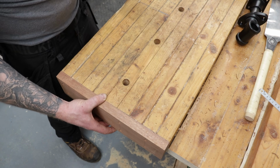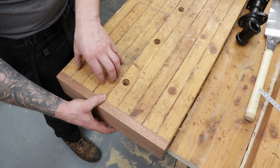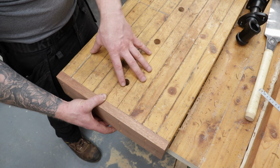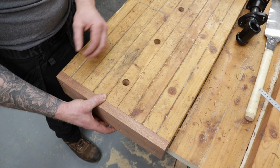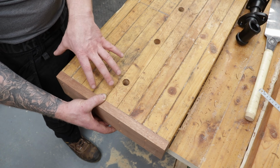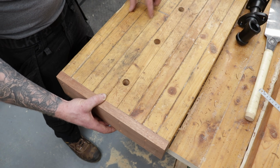We need to take it back off, take it to the pillar drill. So it's going to be screws for now, and that'll hold the end of this together so it doesn't spring apart, because there could be tension in this. It's all glued up, and this wood has shrank and moved a lot. So when you cut down through it, these could pop apart and these walls mightn't stay parallel. So we'll get this end on first and then we'll chisel this out.